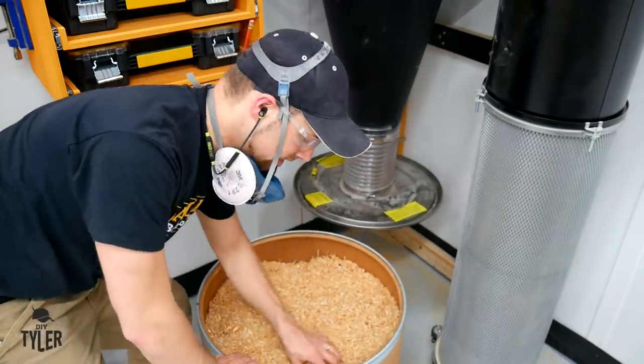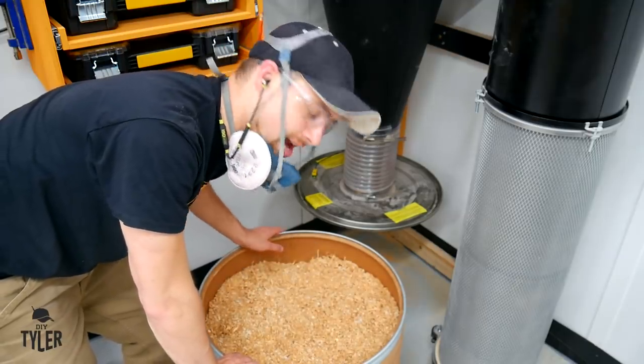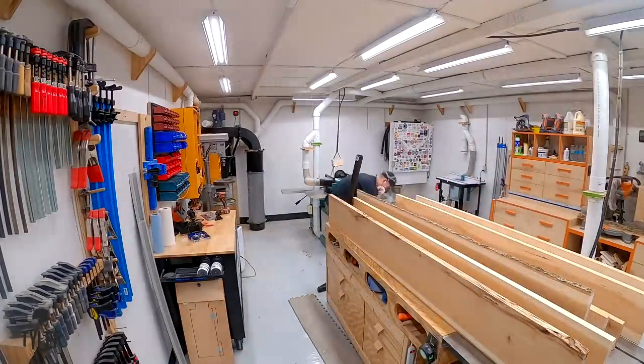This is the third time emptying this now, so that's 99 gallons of sawdust and I bet you I have at least one more to go. At this point the boards have rested for a couple of days. There are two boards that have a slight bow to them. The plan is if I oppose those bows it should flatten everything out in conjunction with the metal legs and the support brackets that are going to go underneath this — everything should stay flat.